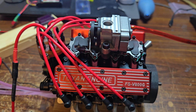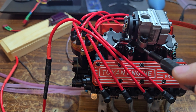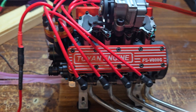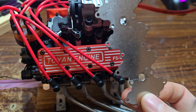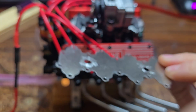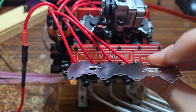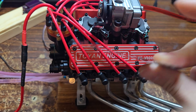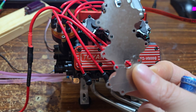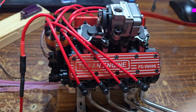The intake — I'm not sure what they were thinking, but you can tell with the design that they set it up to be a dual carburetor system. There are no channels in between this portion; it is separated by this little plate right here. I got rid of the lips on mine because those lips are pointless. You'd be drowning it in fuel trying to get any resemblance of fumes into it so it will start. Unless you're doing a dual carb setup, because this plate blocks off both banks of four — get rid of it. It's pointless.